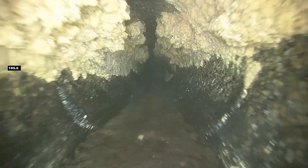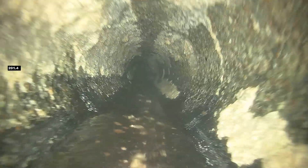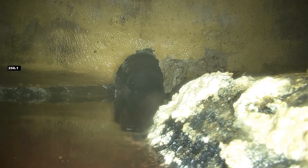FOG is known to build up and combine with other debris in the collection system and can even grow into giant fatbergs. Grease traps are a useful tool, along with proper best management practices, that systems of all sizes can use to prevent clogs or blockages caused by FOG, prevent sanitary sewer overflows, and protect their infrastructure.